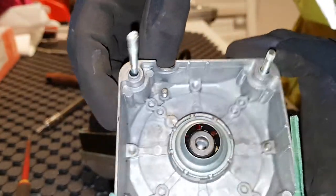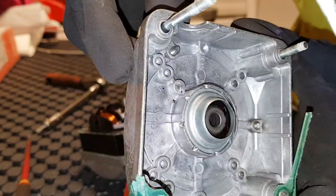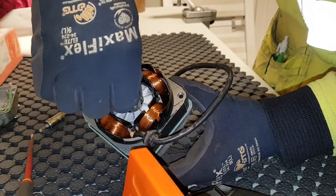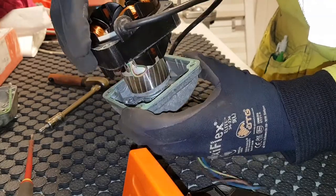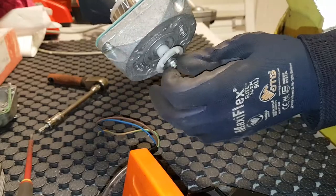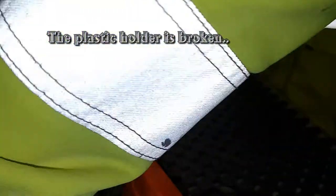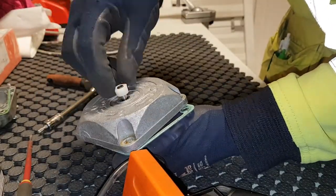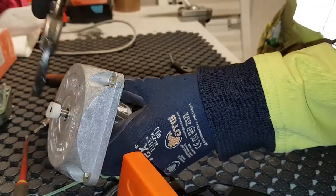It's just very dry. These are the bushings inside — there are two of them in this motor. You've got four windings there, or at least it looks like four, it might be just two. And we've got the rotor here. It's a sort of induction motor. The plastic bit there — the white one — turned out to be broken.